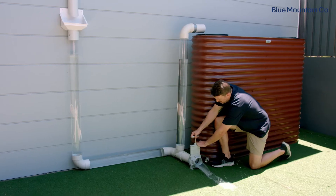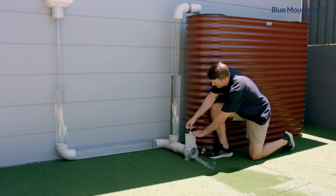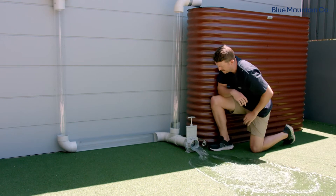Water inside wet or charged pipes can be poorly oxygenated and in some instances might contain sediment or debris. These nutrients and low oxygen levels within the body of water in the pipes can lead to anaerobic fermentation. This is where the water in the pipes can go off and become discoloured. Periodically draining these pipes with a sliding gate valve can help prevent this from occurring.